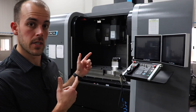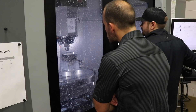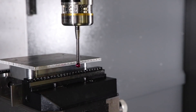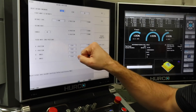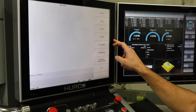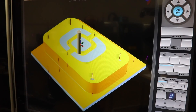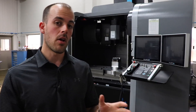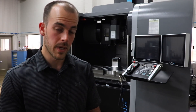Because I'm an absolute dummy and that's a machine I don't want to break, I'm going to use the help of one of our expert application engineers to make sure I don't screw anything up. One of the first things we do is set up our block of aluminum in the vise, and then using the probe, find a center point which we can work off of. Next, we built each block of the conversational control for each operation we want to do for the part. One thing that makes this control really cool is how big the screens are and the fact that there are two of them. On one screen, you can see a simulation of the cut that you're actually programming — this helps you check to make sure things aren't going wrong and you're not going to break a tool or the machine itself. All in all, it took about two hours to set up the program and the tooling to run the part, and with everything programmed and the application engineer's sign of approval, we can actually hit start.